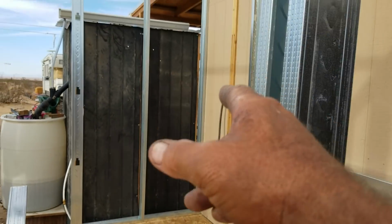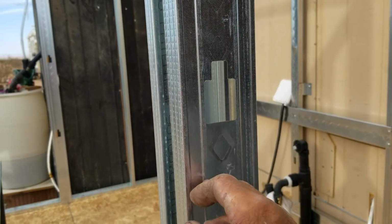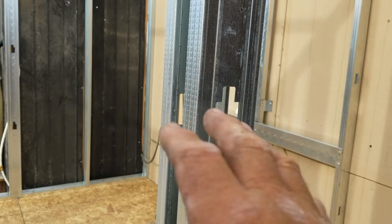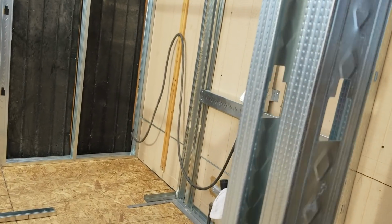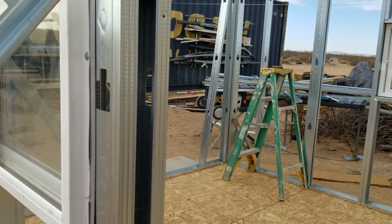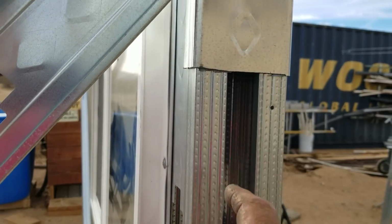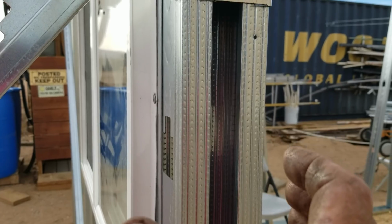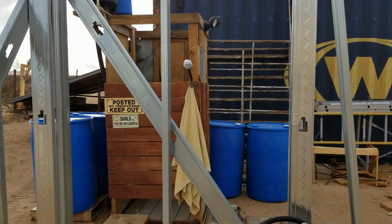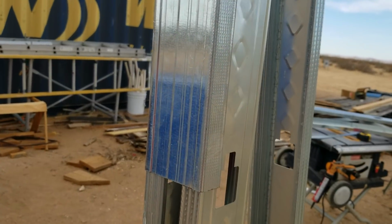And then when I put my stringer boards over the top of the seams, that will have something for me to actually screw the board into other than just the siding. So it'll actually be biting in the studs too. And there's always a space in between here, so I can still run my wiring without having to drill and so forth and so on. Sometimes I put little leftover pieces like this in between, especially around windows and stuff, and that really binds it together, and I'll shoot screws in that before I'm done, but I don't do that until I'm all done, and whatever scrap I have left over, like here, I'll put those pieces in there to give me a little extra strength.